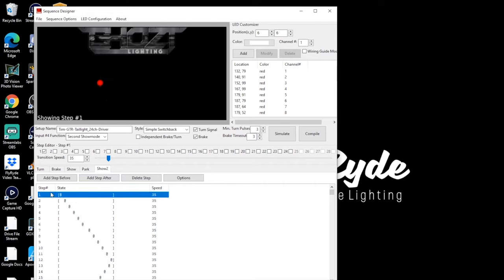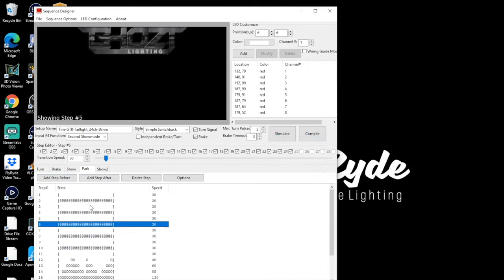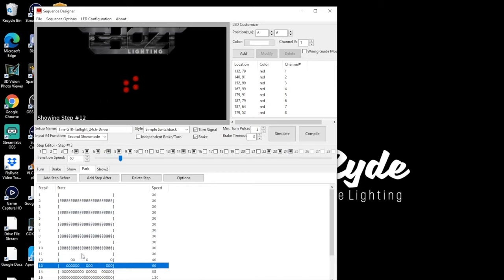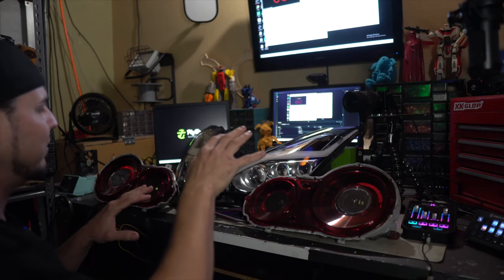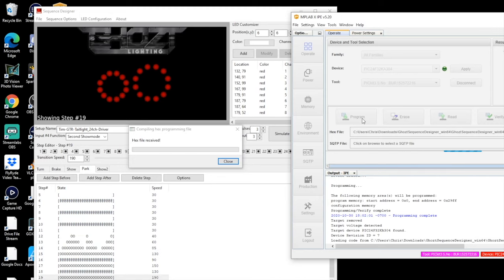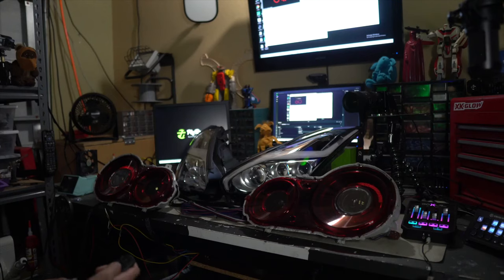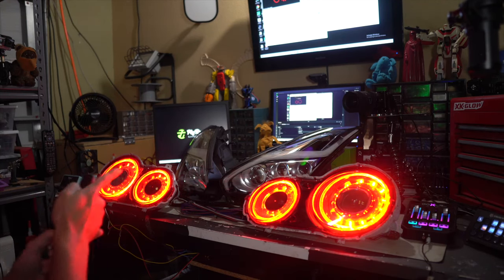I'm going to open a file on the computer and I can see all my different animation setups. The one I want to change first is the animation that shows what happens with the parking lights — it should end up dim, but instead it ends up bright, which means it's kind of mimicking the brake lights. So I'm going to kill off that last step and recompile. I tell it to program and it's sending everything to the ghost module — you can tell because there's a little light blinking. It says done, and right off the bat I get to test it. This should be bright and this should be dim — and sure enough, that is dim and this is bright.